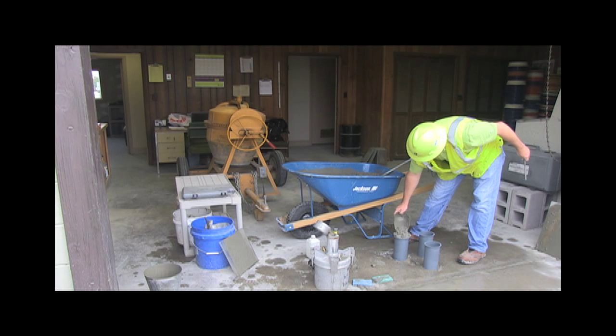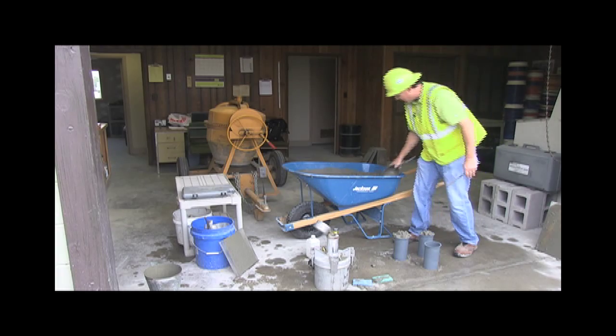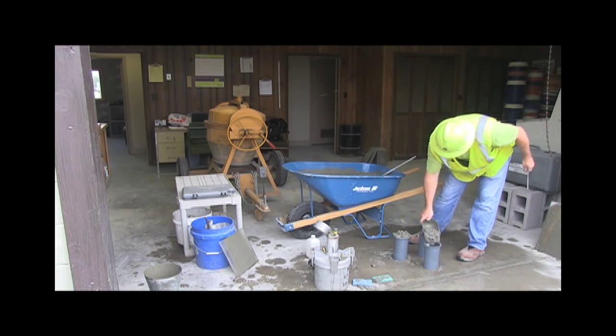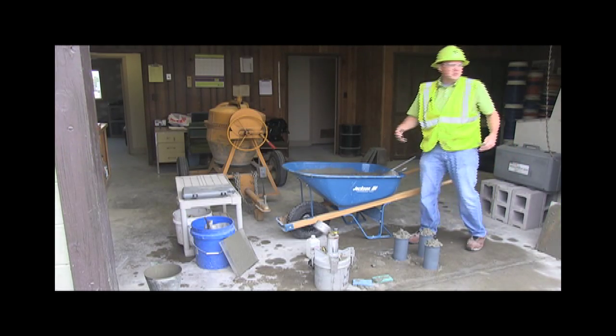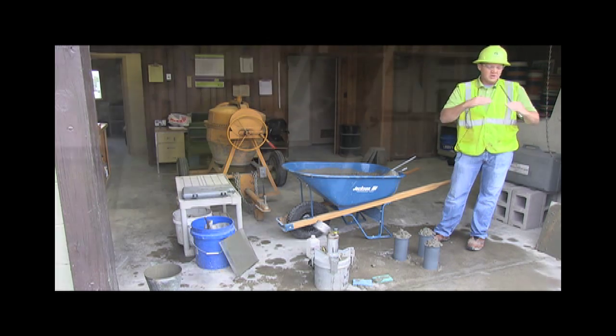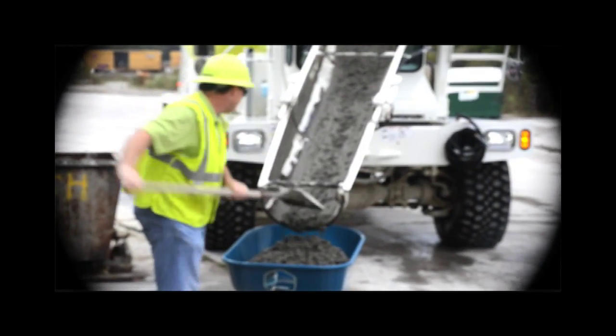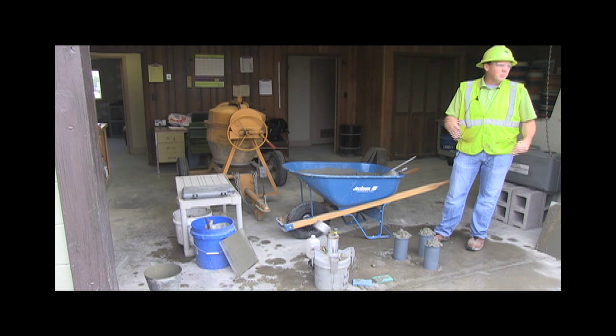Yeah, concrete gets its strength in compression. So when we're trying to squish it together, that's where it has all its strength. In paving, parking lot slabs where you've got movement of trucks or forklifts, the concrete will flex up and down. Airport runways, for example, is a good one. It flexes up and down every time that airplane lands on it. If it didn't flex and it just broke, then we wouldn't be able to land airplanes, you know.